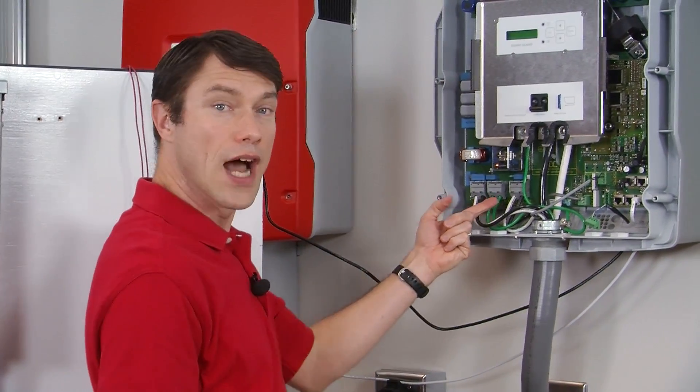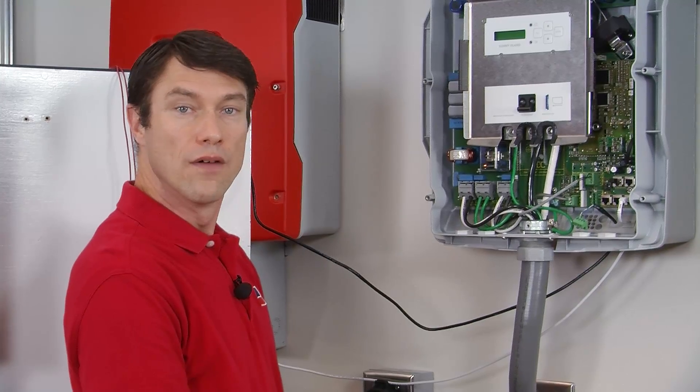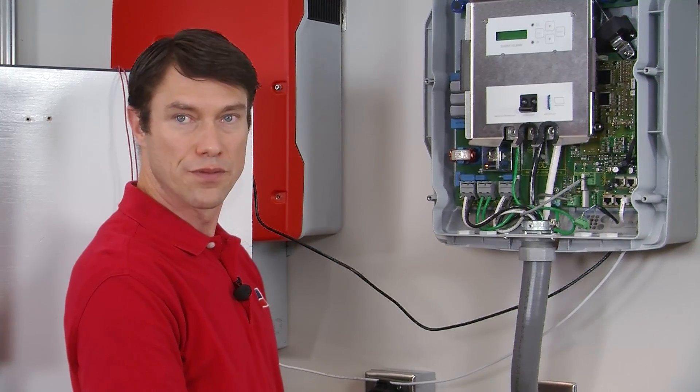As we can see, the Sunny Island only has one set of terminals, labeled AC2 — GEN, grid — for connection of external voltage sources. If the grid or a generator is the only source wired into the Sunny Island, it will know which one it's working with, as you'll set that during commissioning. If it has the potential to work with both the grid or a generator, it needs to know which one it's attached to, and that's exactly what DIGIN tells it — whether or not it's tied to a generator or the grid.